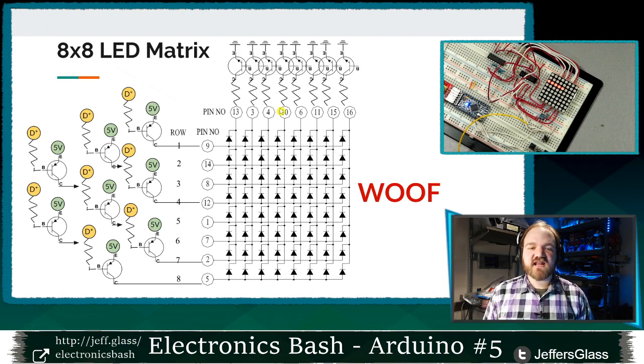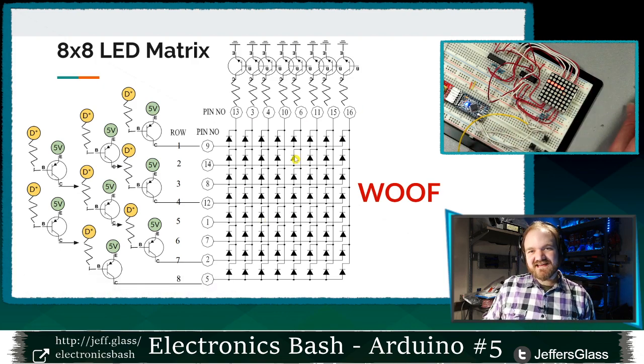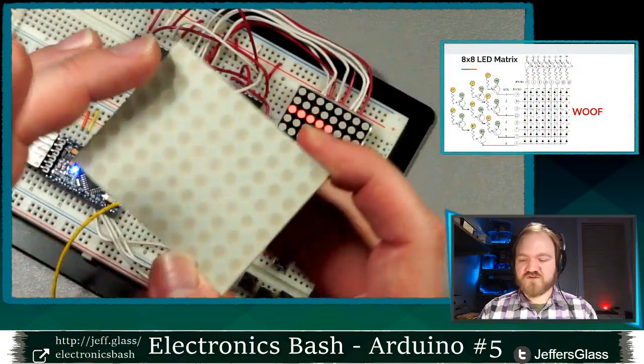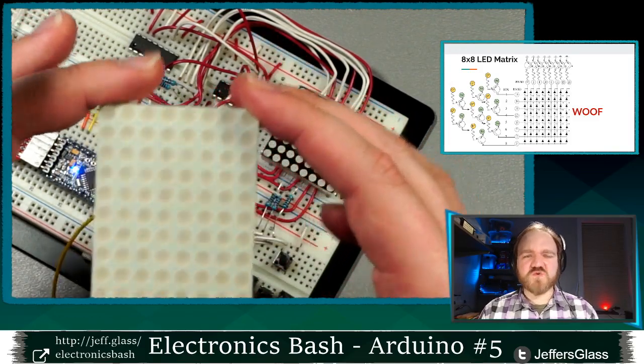But the problem is that as we grow this display, as we think about controllability here, this is taking 8 plus 8, so 16 pins to control this 8x8 display. These displays can get really chonky. This is a relatively small commercial unit. This came out of an LED sign like you might see on the side of a bank or a high school or something like that.